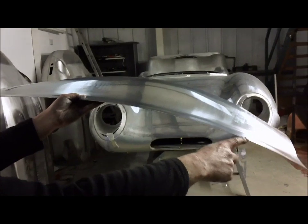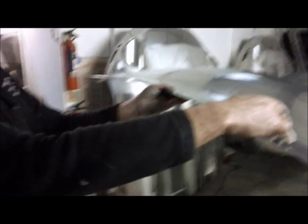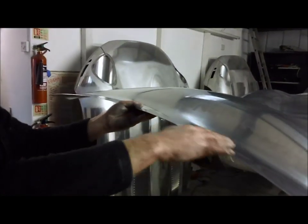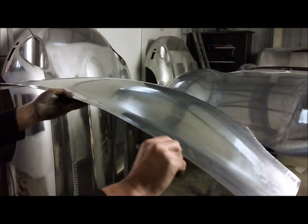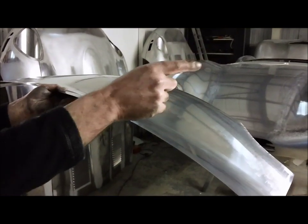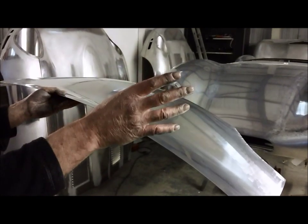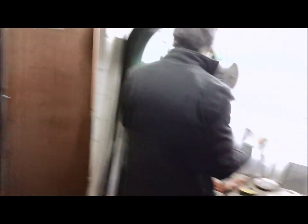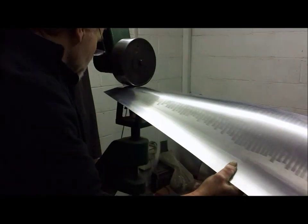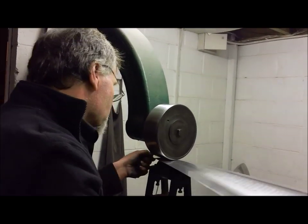See how this area here is expanded more than it is in there? Stretch this area more, then work your metal out to the edge, lighten up with your pressure, wheel it where you want the shape. More stretch here, not here — there. Be precise. That's a big rolling machine, but it's a precision tool, and in the hands of a craftsman you can do it. In the hands of an idiot, you're wasting your time. Only want light pressure now and we're going to finish up. We're back to pattern number one, Bill. All right, ready?